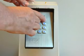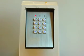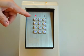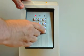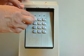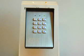Press 1234 pound to test. Relay 2 is in toggle mode — you can see where it came on and stayed on. The red light is continuous and the yellow light on the relay contacts shows it is in constant mode. To release it, press the same code again and it will release. Relay 1 is still in momentary mode, and you can set your output time.